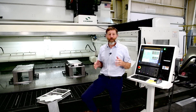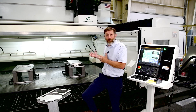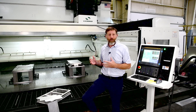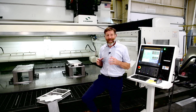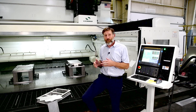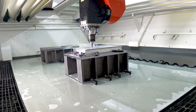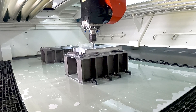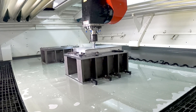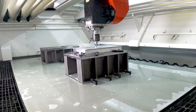Friction stir welding is well suited for the aerospace, automotive, and marine industries. In the case of a battery tray for an electric vehicle, when you need a strong, defect-free bond without the added weight caused by bolts or rivets, and without using flux, fillers, or other consumables — not only does it deliver higher joint strength than many other methods, but the fused area in most cases is stronger than the individual base materials due to refinement of the material's grain structure in the friction stir welding process.